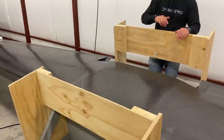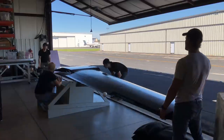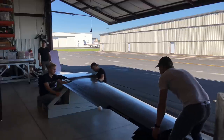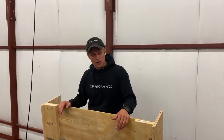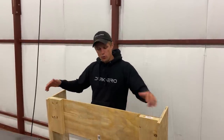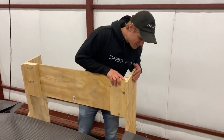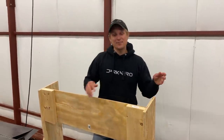The reason we're not starting over from scratch is that a lot of work went into the first test fixture — getting it to interface properly with the wing involved a lot of hardware and tight tolerances that consumed far more time than expected. So instead of redoing all that effort, we're moving forward with what we have. I built these legs by cutting them out of scrap plywood and attaching them to the existing fixture.